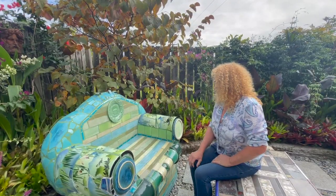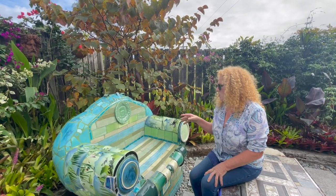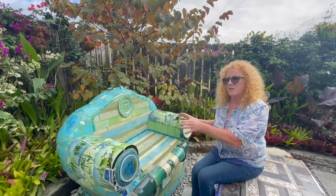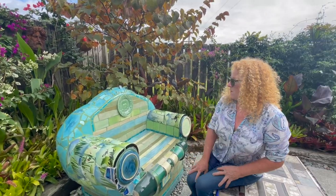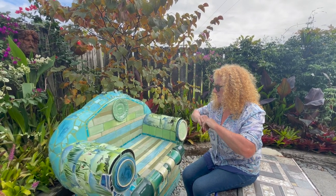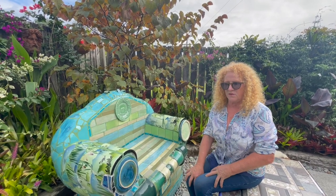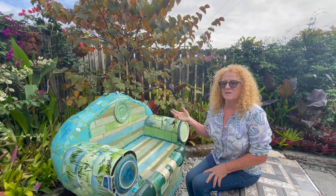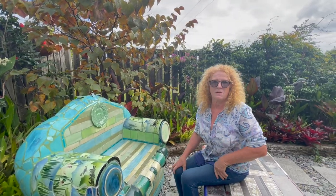The other thing I could really mention is for your colder climates, like people in Canada, is make sure that you have the right tile that can withstand the freeze and thaw situation with tile. So the tile you pick, and even the ceramics you might use, if you're in a cold climate and it freezes and then thaws, it expands and retracts and it will pop the glaze off. So you'll basically fail if you don't have the right tile. Now in the colder climates, you'll probably be selling on purpose a glaze that can withstand that freeze and thaw. We don't have to worry about it here. It's a much more temperate climate.